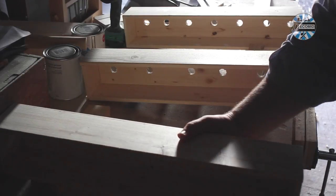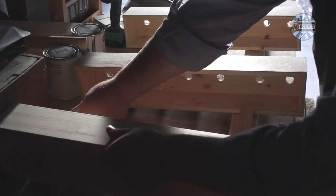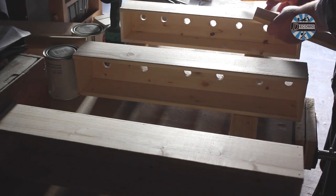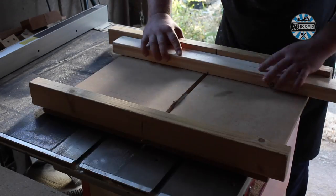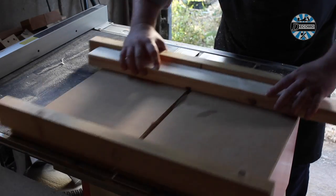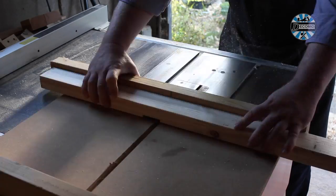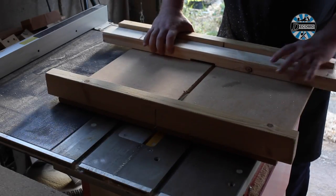Time to look at the frame. To look its best the trays need to be evenly spaced. I used offcuts to act as spacers so the trays could be marked up more easily. I made the marks on the wood before splitting in two lengthwise — this ensured they would be level once parted and mounted on the wall. It was then a simple case of cutting the three housings in the batten. I've used the crosscut sled here but you could make this with a router plane just as easily, if more slowly.